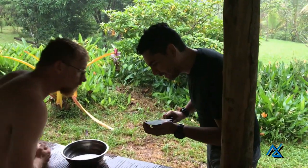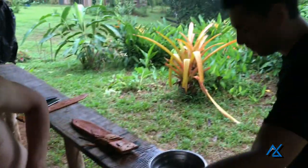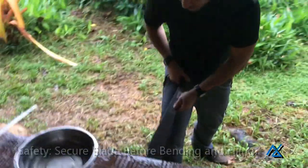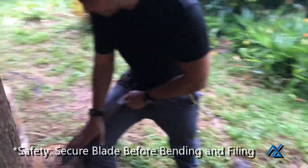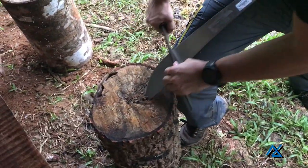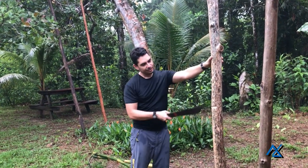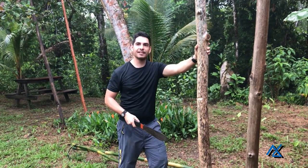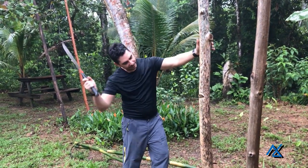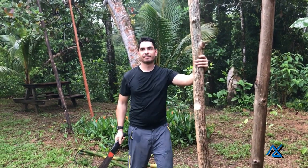Once you see the green grind marks starting to go away, what you do is take one of those files and — this is a very critical part where safety is an issue — lay the machete right here at the tip, use your knee to put pressure on it, and then take the file and start scraping. Obviously the less grind there is, the more effective that scraping is going to be. You work at about 45 degrees — in and out — and you work your way around.